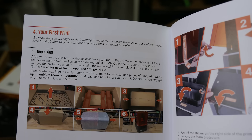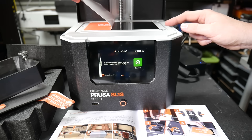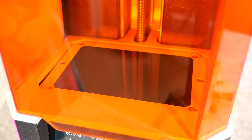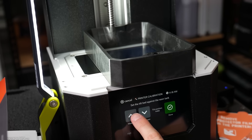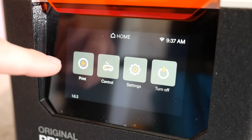The first time setup is really well described, but quite involved, so take your time and do it right. Something new for me with the SL1S was calibrating the tilting bed mechanism, which is a feature that really sets this printer apart from other MSLA printers on the market, but does mean you have to calibrate it to be perfectly flat. I used a strong light source on one side to help me see gaps, and nudged it using the touchscreen into position.